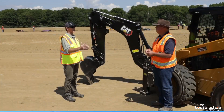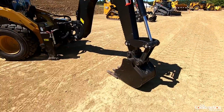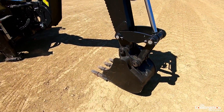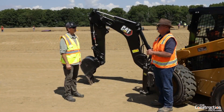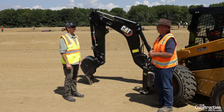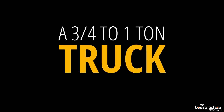What's the total weight on a rig like this with the backhoe — what can they pull it behind? Like a 250-level pickup truck? Folks using the 259s up to the 299s are running on trailers, probably 20,000 pounds or less — 14,000 to 17,000 pounds. So if you want to talk on truck size frames, it's going to be a three-quarter to one-ton truck. Comfortably move these around.